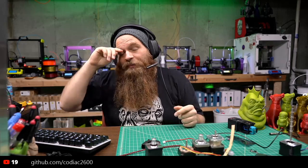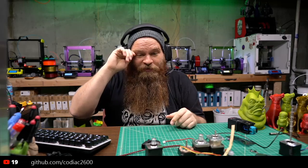It's probably not. In Marlin and RepRap firmware, so if you have a Duet, you can probe closest to the left Z-axis motor and the right Z-axis motor, and it will line the gantry automatically for you. I'll show you that in the next installment, because the next video is compiling and uploading that firmware to the printer, and then I'll run you through all the cool features. When you do that Z auto align, it takes into account that the bed might not be leveled perfectly to everything else, so it'll level the actual extruder and everything else to the bed. It's a really cool system.